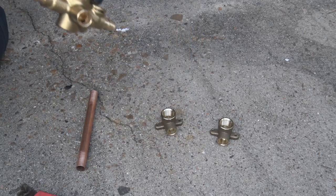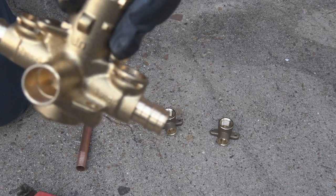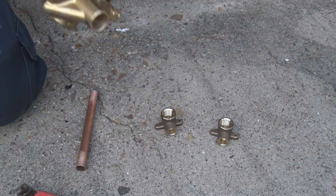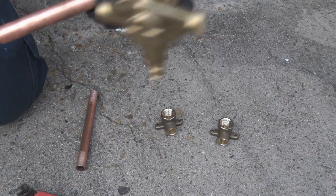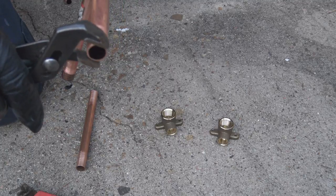And by the way, this is probably the most copper pipe soldering that's going to be done on this job site. Other than that, everything's going to be PEX. But there are areas where you'll see copper, and this will be one of them. And then you'll see galvanized pipe on the stub outs. I'll show you those later and throughout the video. Galvanized stub outs, it's because we want some type of rigid pipe.